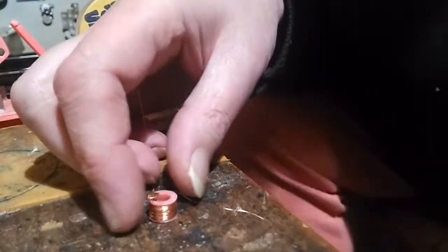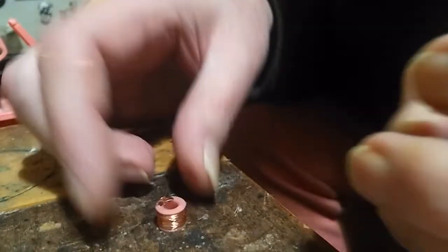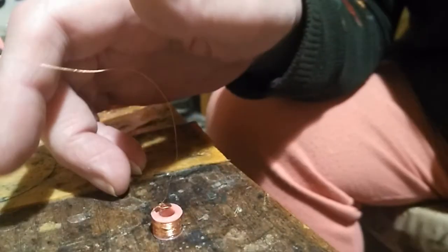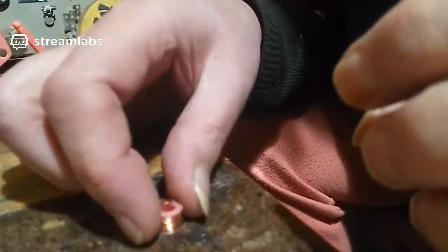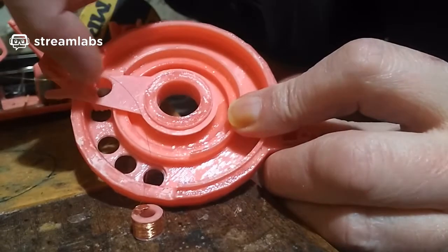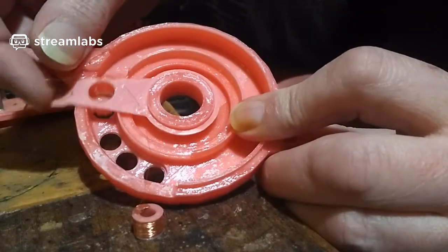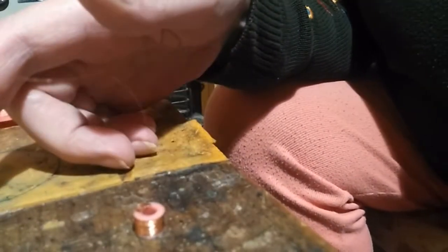This is my trigger coil. I'm making two of these and it's very fiddly because the wire is very fine — it's 44 SWG. We don't require much current, we mostly need voltage, and the coils are small and tiny because they have to fit inside the end drum.